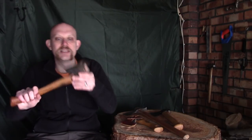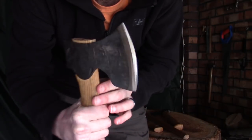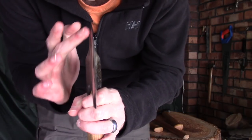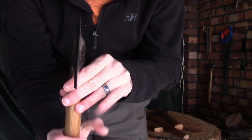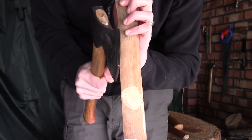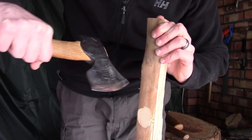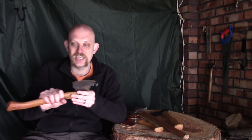Next up is my other Gransfors axe — this is their Swedish Carving Axe, I think it's the large one. It's got what's known as an asymmetrical grind, so you can see from the profile that one edge has a bevel on it and the other edge is flat. This is a right-handed bias because I'm right-handed, so I'll generally be using the flat face of this axe to cut into my wood. If you try it the other way around it just doesn't work well — the axe tries to skip off. This is what I class as a dedicated carving axe, designed exclusively for carving, and it is by far my most used carving axe. It's got quite a heavy head so you can allow the head to do the work — you don't have to put loads of arm strength into it, you can almost just let the head fall. So if I'm doing a lot of carving or something quite big like a serving bowl, this is my go-to axe.